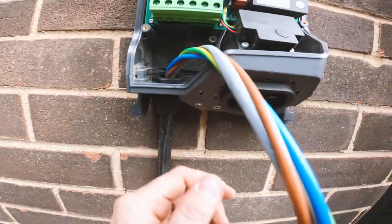We've got the charger mounted and we're clicking this cable up using cleats. We've got it stripped in there with the earth. We've basically isolated the earth from the house because this has a built-in PEN fault detection. What that does is: you've got your live, earth and neutral coming in, and it runs through the PEN fault detection. If it measures greater than 70 volts between earth and neutral, it will shut off any charge and disconnect the live, earth and neutral. If the neutral coming into the property was severed with the line still live, anything metal — or your car on the driveway — would become a massive shock hazard. The PEN fault detection disconnects that and saves your life. If you bypass it by putting an armoured gland in and earthing the chassis to the house earth, you've just bypassed that earth disconnection — it's essentially an earth switch that disconnects earth, line and neutral simultaneously.